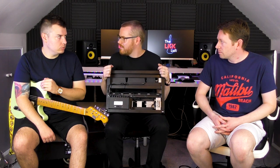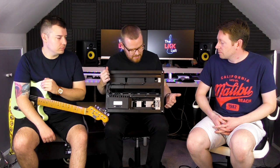Could go into the science of it. Not going to bother. It's basically it makes sure that you're not losing any signal, any clarity, any signal power through all the cabling. Because every time you go through a bit of cable, every time you go through a pedal, through a switch, back out, you're adding cable. Longer a cable gets, you get more resistance, that kind of thing builds up. And so you've got the potential to lose signal, and you always hear that as a treble roll off first.